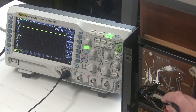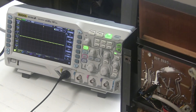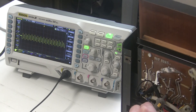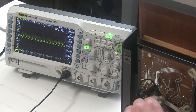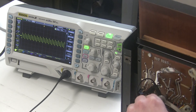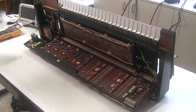Using the oscilloscope on the 25 volt rail, I'll switch to AC coupling so we can see the ripple clearly. The ripple measures about 400 millivolts peak to peak — that's the capacitor charging and discharging causing the voltage to fluctuate. This would be completely flat if it were a regulated power supply.